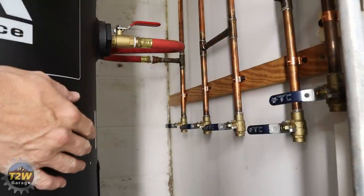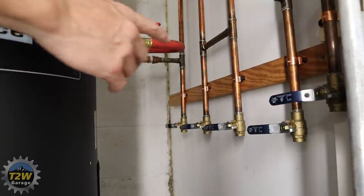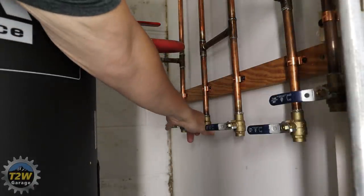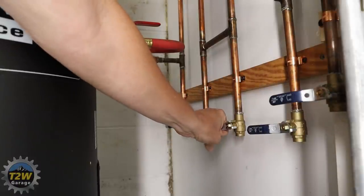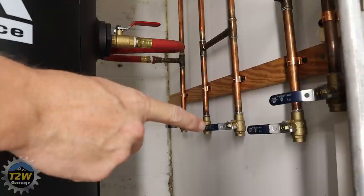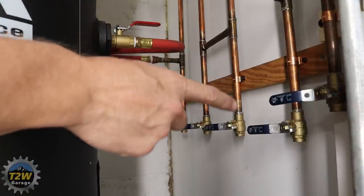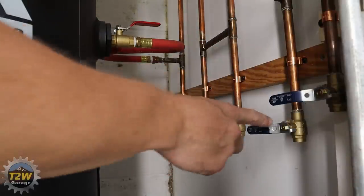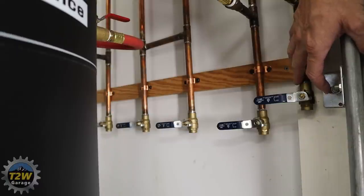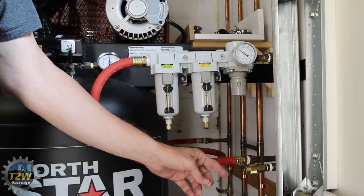At the bottom of each down leg I have a section of pipe with a ball valve installed. I can come in and open these occasionally to drain any water that's collected. I do get water in these — usually a lot in that first leg, a little less in the second. The first and second legs are usually where moisture collects. Very rarely will I have any moisture in the third leg, and almost never in the fourth. There's also a fifth leg on the output side of my regulator where I never have moisture, but I have a ball valve there just in case.